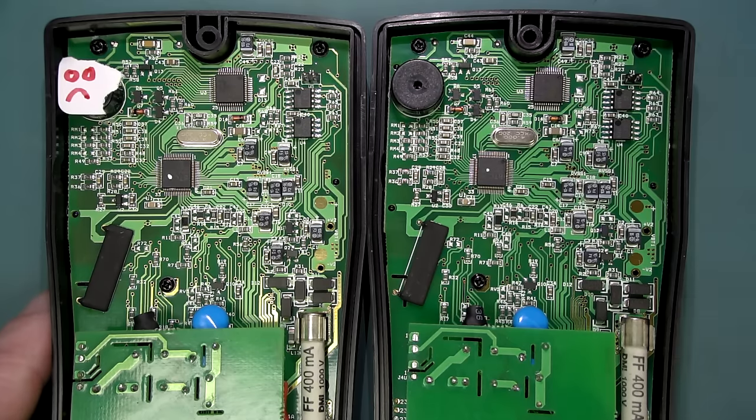Let's have a squeeze around here. Once again, I'm looking for bad joints. Hello — hang on. L9... is that my imagination? Hang on. I thought there was no fillet on that — but it's all good. So I'm looking for bad solder joints, solder balls, shorts, other things. What's going on down there? Hello — L3. Ta-da. Look at that.